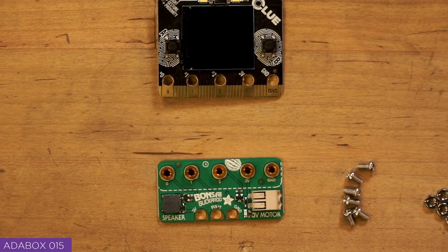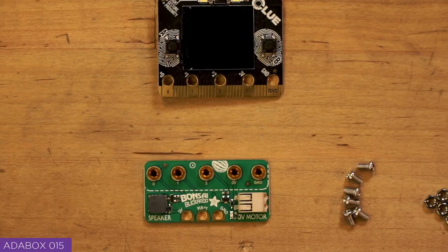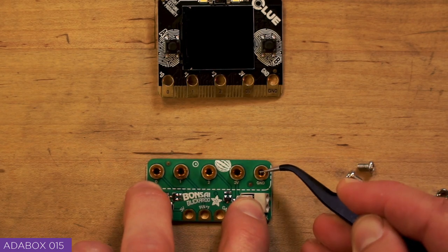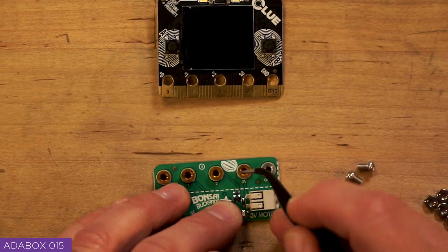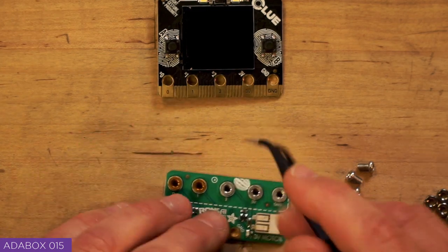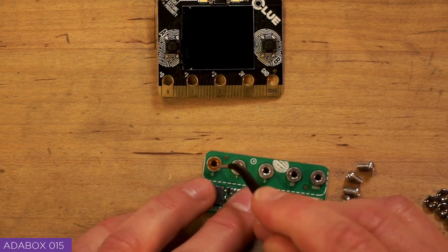Now we'll have a look at how to connect the Bonsai Buckaroo plant controller board to our Clue. The first thing you're going to do is remove the little Kapton stickers that are over these connectors. These are here just because of the manufacturing process. We use a pick and place machine that grabs and places these boards for soldering. And I like to just poke through them with some tweezers and then peel it off. You can also get a hobby knife or maybe even the edge of your fingernail on the side of that and lift.